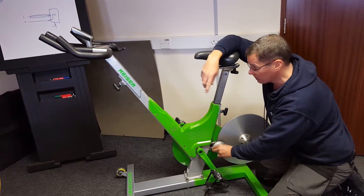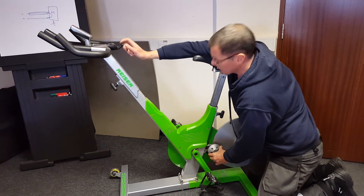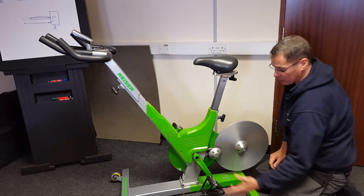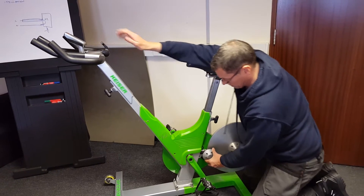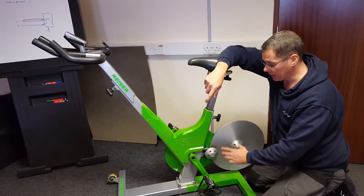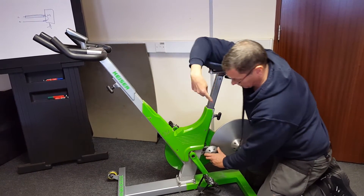What I'm interested in is: when I move the lever, do I get that full range of mechanical movement on the spindle? The way I test that is I turn it with my fingers to the mechanical stop and hold it, then adjust my gear lever which pulls the cable in down here. Now the cable should be tight so that when I let go, the spindle shouldn't move — which it doesn't. If the cable wasn't tight, when I let go the spindle would come back ever so slightly, just like that.